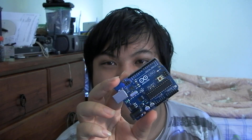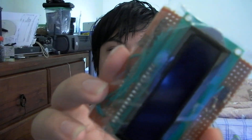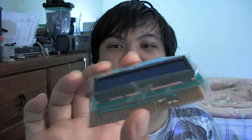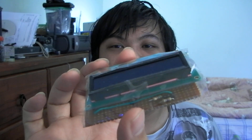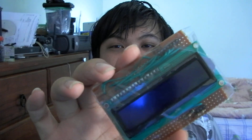The other way you can do it without a parallel port is use a USB port or a serial port. You'll probably recognize one of these — it's an Arduino board, quite a useful board. All you have to do is grab yourself an LCD and interface it to the Arduino by making your own little circuit board. As you can see I've used Vero board, with fixed resistors to set the contrast again and a whole batch of ugly green wiring.